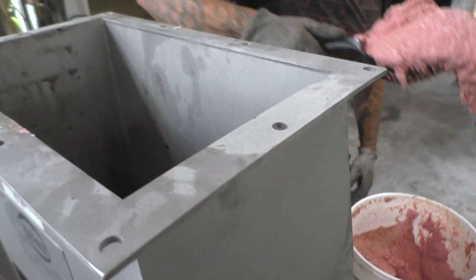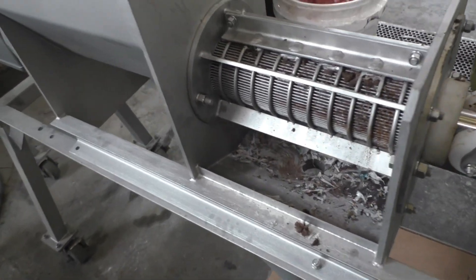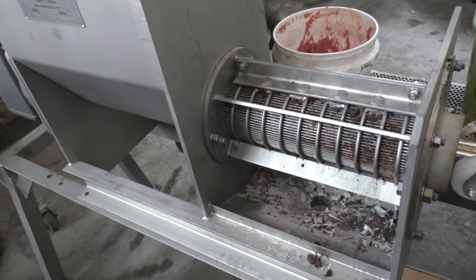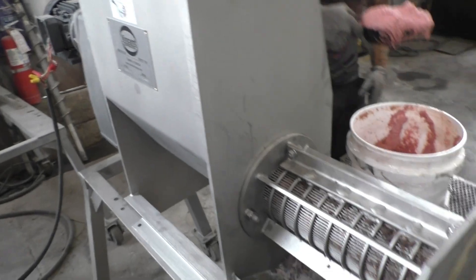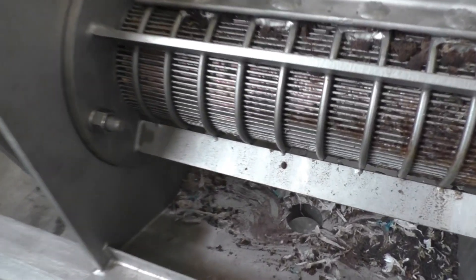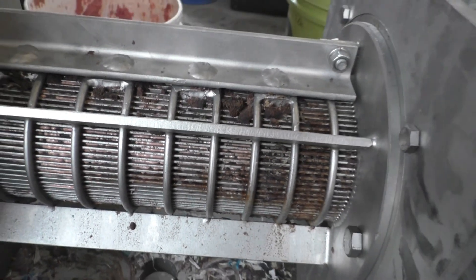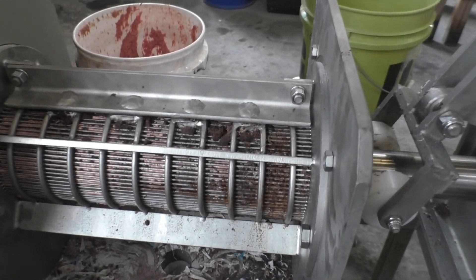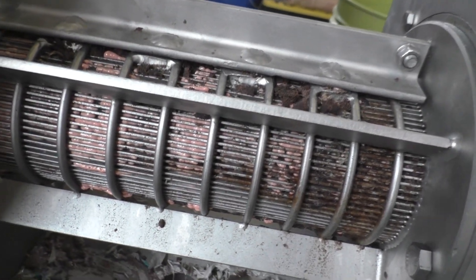It's out okay. Got the air pressure closing the discharge cone here, set at 10 psi, which barely moves the air cylinder. I set the speed very slow, 7.5 RPM. I'm starting to get some material progressing through — can you see it there? This is the same screen we were using the other day. The slot width is incredibly tight — the tightest we make: 5 thousandths of an inch.